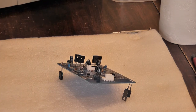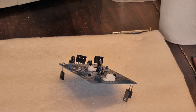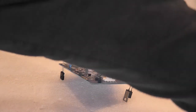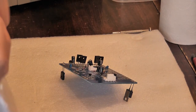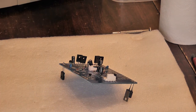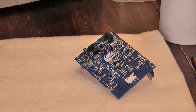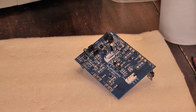People say 'I'll recap it, that'll fix it' - but in all my years of fixing things, it's 95% not capacitors. People who fix old radios will tell you different, and they're right that old capacitors are often the culprit there. But for amplifiers and similar gear, it's generally transistors and resistors - very seldom capacitors. If it's a very old amplifier that's still working but not working well, it's probably capacitors. But not modern ones.